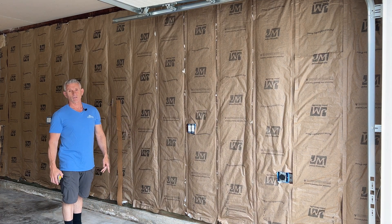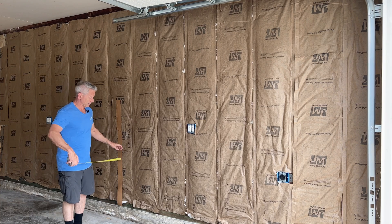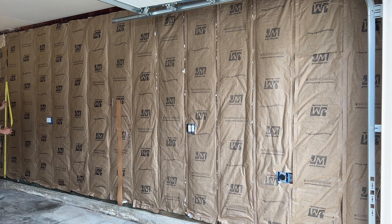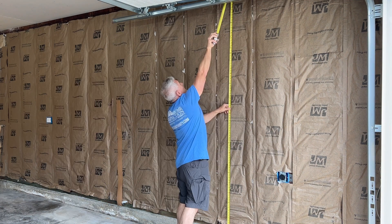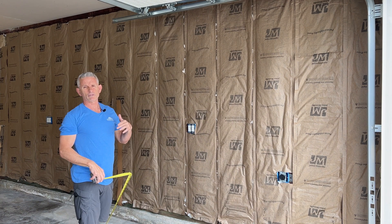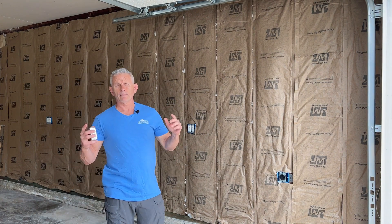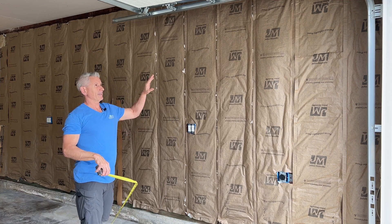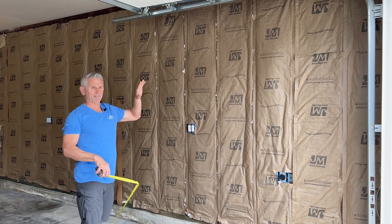It's been here since 1944. So what I'm going to do is take my tape and start from one end and work my way to the other — from the bottom of the sill plate all the way up to the top plate where the ceiling is. The average of the measurements I just took is between a hundred inches and a hundred and one-and-a-half inches. So I'm going to cut my first sheet at one hundred inches long so that when I go to put my sheets up I'm not going to get bound up on the ceiling and have to beat it in with a hammer.